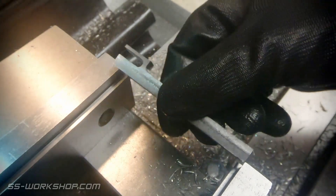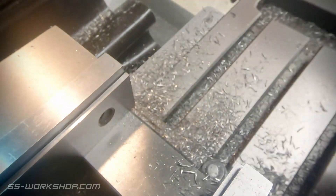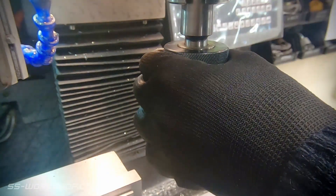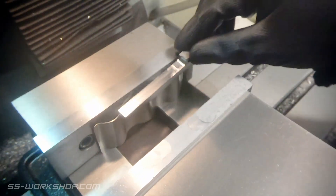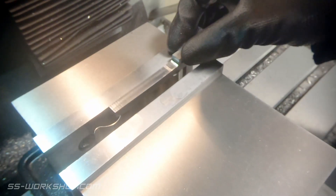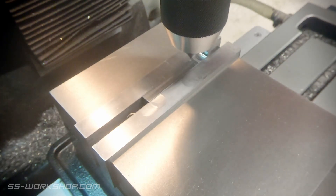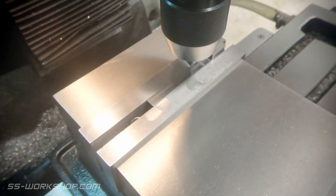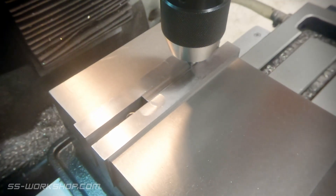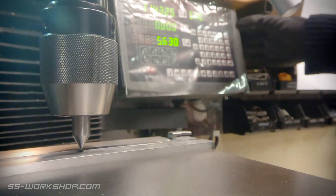With the fork finished, it's time to drill the holes, so I switch to the drill chuck and use the wavy spring parallel for support. The trick with these wavy spring parallels is they can move out of the way if a drill bit hits them. If you don't have a set, you can actually make your own using some steel packaging strap. I set the digital readout using a pointer that I turned in the lathe, as the hole locations in this part aren't highly critical, so close enough will be good enough in this case.